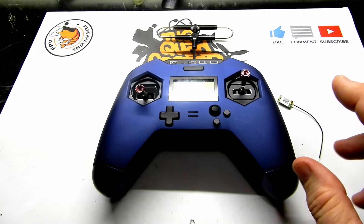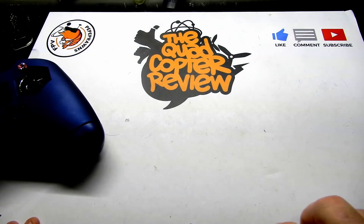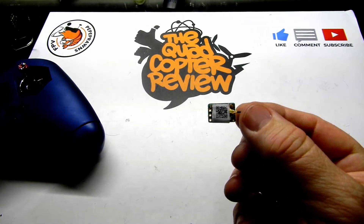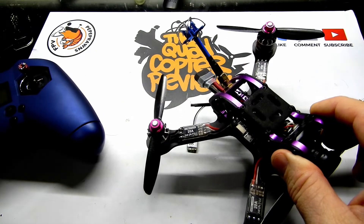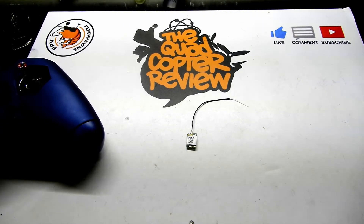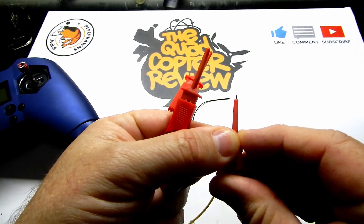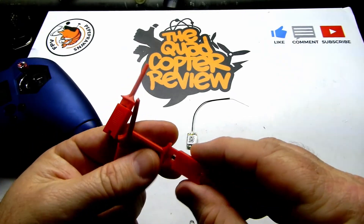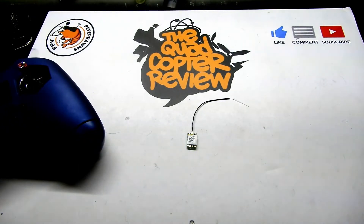I'm going to show you a couple of ways — we're going to do it without having it soldered on to a quad or anything at all. I'll show you how to do it with a plug setup kind of like on the XSR, and also what it'll be like to set up a plug on a soldered receiver. We've got a regular XM and an XSR in this armor tin here. The first thing we're going to need is some way to connect it without solder. I got these little wire clips for an analyzer that you can get from Amazon.